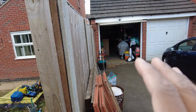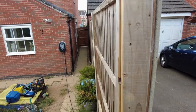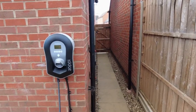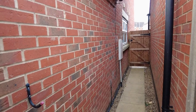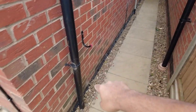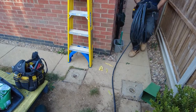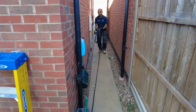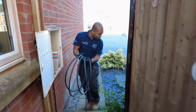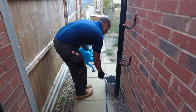We had a look at all three of them. The garage fuse box is actually a lot smaller — it only has a little 2.5 mil cable coming into it supplying power, so that's not good enough for what we need because we've got a 7 kilowatt car charger. Then we looked at the option of coming from the consumer unit — again, it's a bit congested, it's inside the kitchen unit and we didn't really want to drill into kitchen units to get the cables in and out. So we decided to come off the electric meter cabinet, clipping the cable neatly along the bottom edge and then into the charger unit.